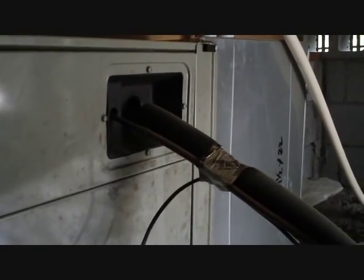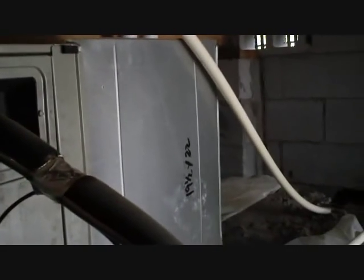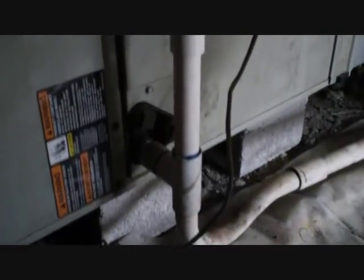When I see this sort of thing with the line set, it just longs for a bender — I imagine it being bent straight down and over, or straight up. It looks so much better, and you have to crawl across this to get over here. I'd also love to have an access door for that coil; it would've been great instead of having to cut my own. I almost thought about buying some of those fire damper access doors just to put in there so I could see the coil and clean it more easily.